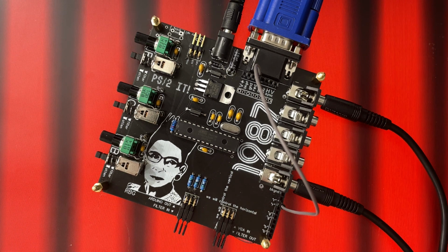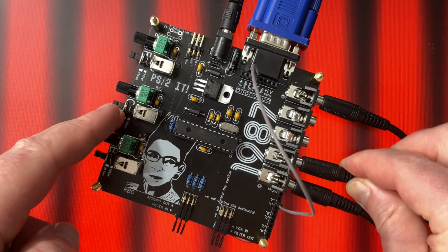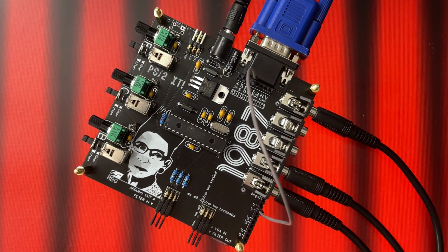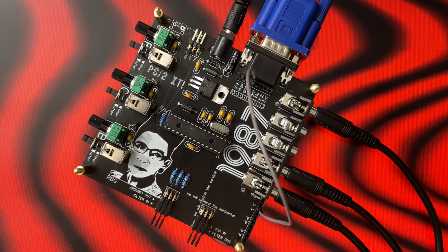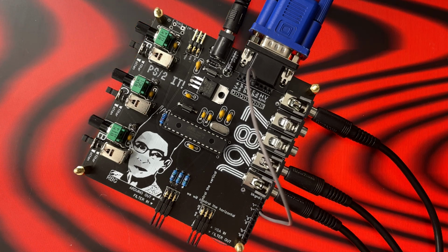We could also even take the vertical sync out, and I'll sync another oscillator with vertical, and then I'll use that to frequency modulate. Now I got another oscillator that's vertically synced, and then yeah, good. Ooh, nice. Now we got the old frequency modulation with two synced oscillators.